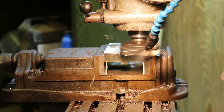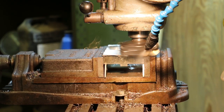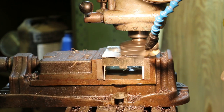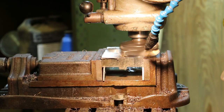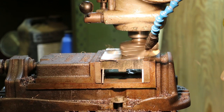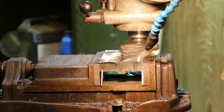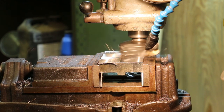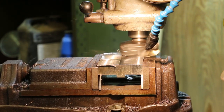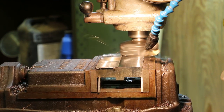We've been working on milling this block down. Had a good bit, about 3/4 of an inch of material, that needed to be removed. And it's just been a time-consuming job, taking off a little bit at a time, nibbling away on it. I did switch out to my other face mill for doing this, mainly because it's got a different geometry on the cutter. It's more of a diamond shape, leads into it at a 45-degree angle, as you can probably see on the side there. And for just doing face milling like this, this particular face mill does a really good job. Once we get back in there and start cutting the shoulders on that indexing tab again, we'll switch back over to the one that has 90-degree shoulders rather than this one that has 45-degree shoulders.